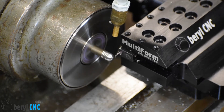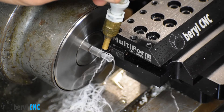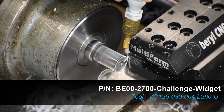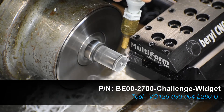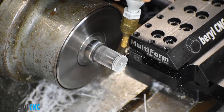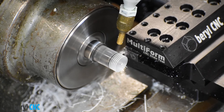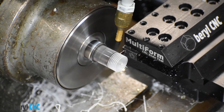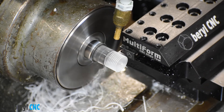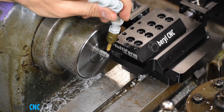When I was in that position, I didn't find any CNC lathes that satisfied me. They were too expensive, or they were way too small and still expensive. So that's when I started looking at what it takes to convert one of these things. I came across the usual — take the hand wheels off, add servos or steppers in place of that — but it was just too much modification to the machine. I wanted the machine to retain its value. So that's what started me down the path of looking to do an actual tool that was CNC in itself that you would mount onto the machine. That's really what the multi-form system and the whole VersaGroup thing is about: being able to add a CNC tool to a lathe and very quickly have the capabilities of a CNC lathe.